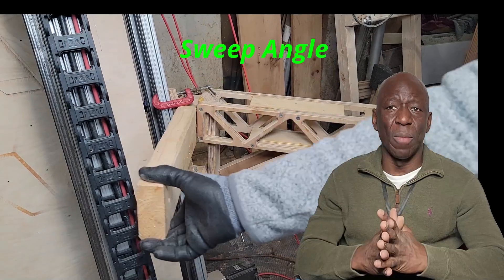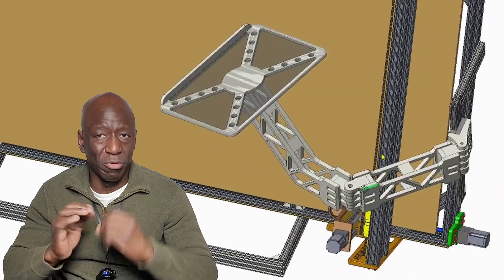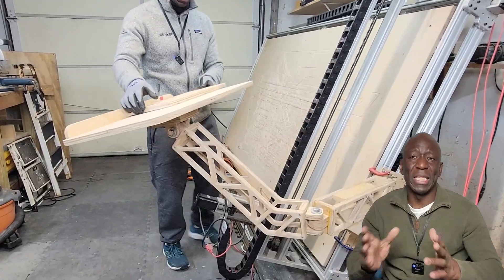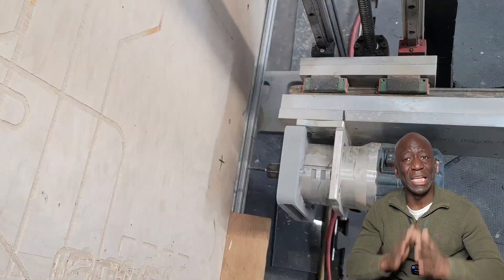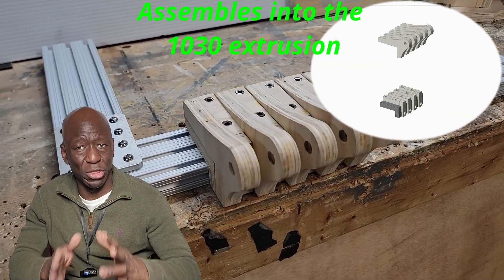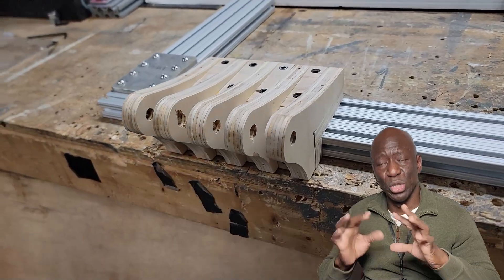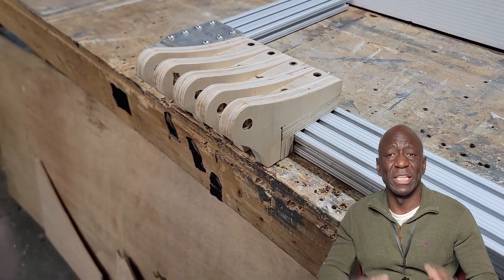The existing arm offers a limited sweep angle. The new mount is designed to provide a larger sweep angle for the entire arm, which will make it easier to set the Z axis height offset. The mount is designed to assemble onto a 10-30 aluminum extrusion as shown. The multiple flank design also ensures vertical stability of the entire arm. I actually got this idea from another YouTube video.